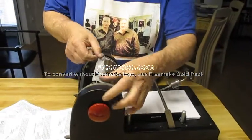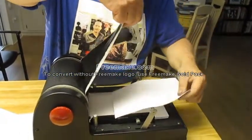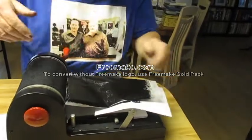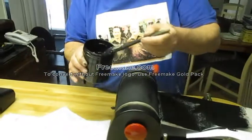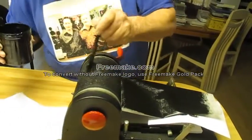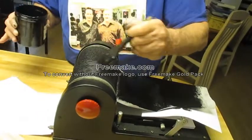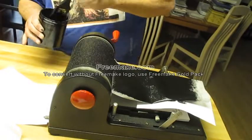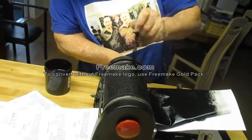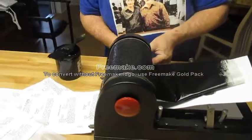Just undo this, peel back the stencil until you get to the part that's closed. Take your mimeographing ink — this is more of a pasty ink — and you can put it on just like this. I usually use a thinner ink but I'm trying a paste ink to see if that will make a better copy. You don't have to do the whole pad, because you don't want to get ink all over everything. Just stop and do this piece here. That's all there is to inking this. You can ink the inside if you'd like, and when you need to re-ink you brush that and it'll push the ink through.